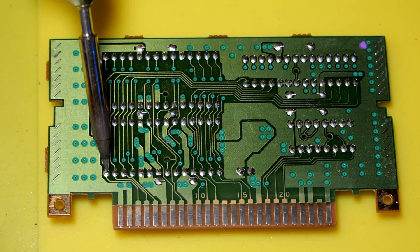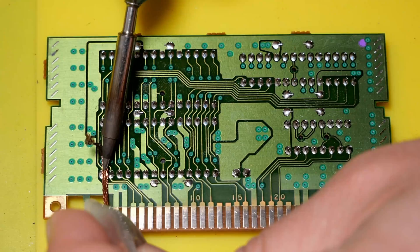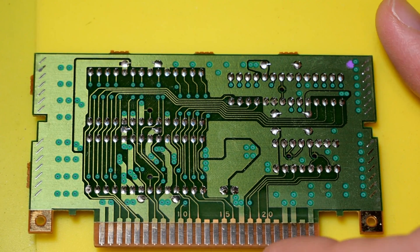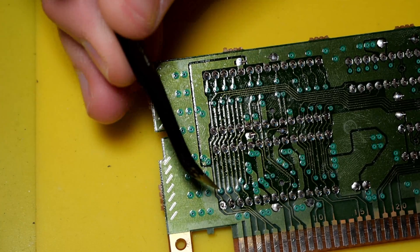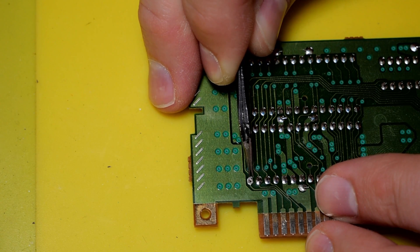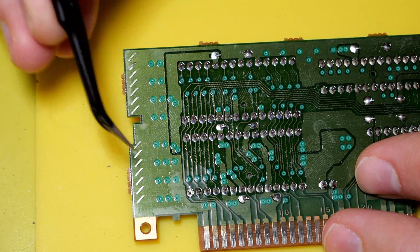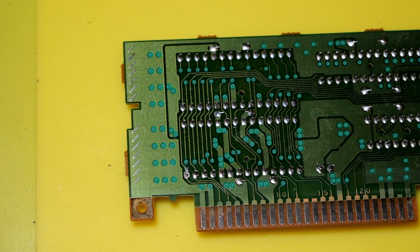So what we're going to try is remove the solder around this pin and then just re-solder it down, and see if that makes a connection, because it doesn't look like there's anything going through that path where there's a break. Just wondering if maybe this one is loose here. If you're doing soldering, make sure you have safety goggles on — it might get a little loud. I'm going to put my exhaust fan on. We'll take our desoldering wick, set it here, and soak up that solder. Then I'm always a fan of taking some 91% isopropyl alcohol on a Q-tip and just cleaning up around that spot. With the solder removed, there is actually a little bit of a break right there.